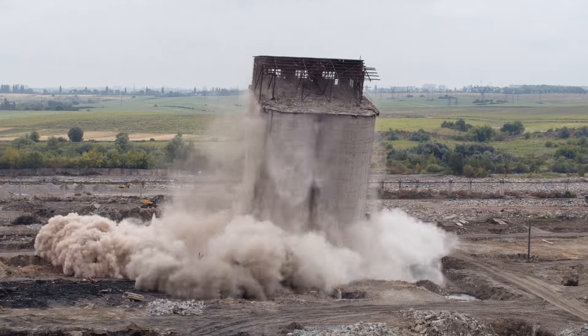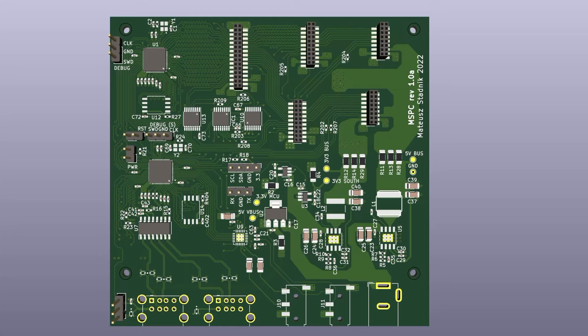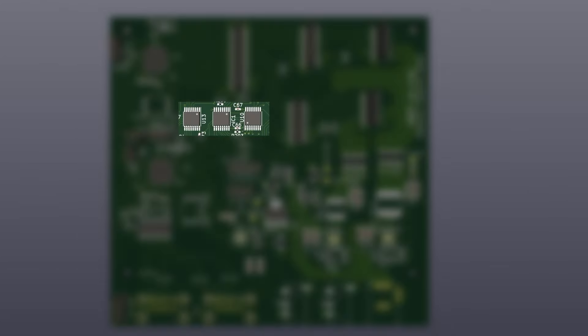That disrupted my plans. Why? With RP2040 I had a few problems to work around. Firstly, the RP2040 package contains fewer GPIOs than I required, so I used two RP2040s and IO multiplexers for the motherboard.